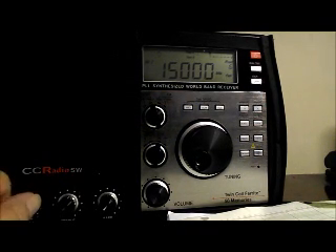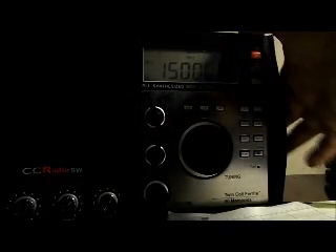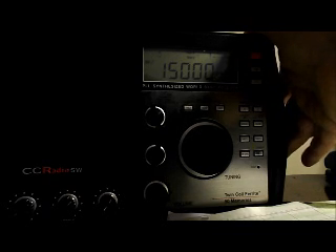I'm going to leave it here on the external antenna. There is no loss of signal strength — it's just that the noise goes away. It's just astonishing to me what the balun and grounding the antenna to a cold water pipe did. The external long wire is 70 feet plus, strung under the house, a few feet off the ground, with a short ground wire from the balun to the cold water pipe — maybe a foot or so — and then maybe 10 feet of coax to the back of the radio.